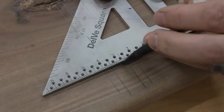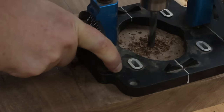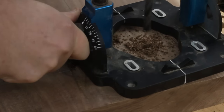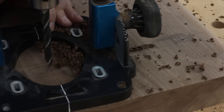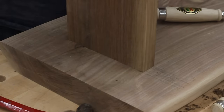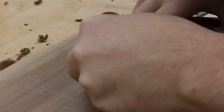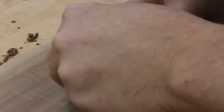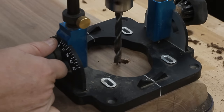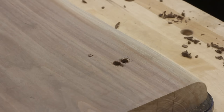Now it was time for the mortises to be cut into the slab. Just like in the bottoms, these mortises are for the uprights and for the sides, but the ones for the uprights will be going all the way through the slab. Like before, I used a drill to remove as much of the waste as I could. Since I can't heave this behemoth up onto my drill press, I used a drill guide to make sure the holes were perfectly vertical. Afterwards, I chiseled out the mortise just like the others, cleaned out all the shavings, and made fine-tuning adjustments until I had the piece fitting all the way up to the tenon's shoulder. Since the mortises for the uprights go all the way through the slab, I needed to transfer the location of the mortise around the end and up onto the top of the slab. I wanted to protect against tear out by drilling and chiseling from both the top and the bottom and have the two mortises meet in the middle.